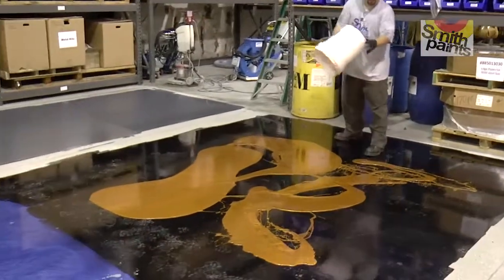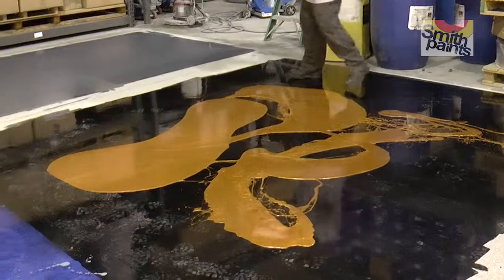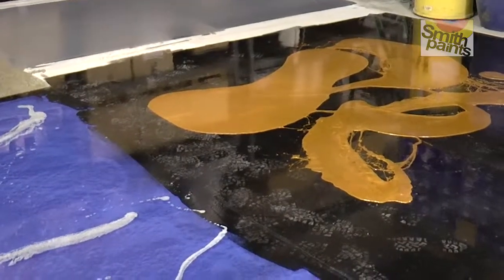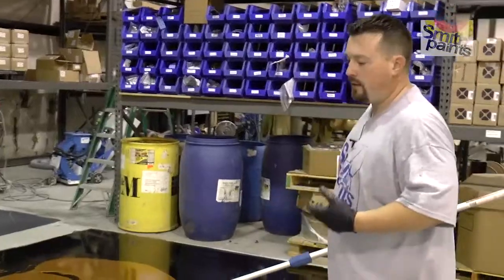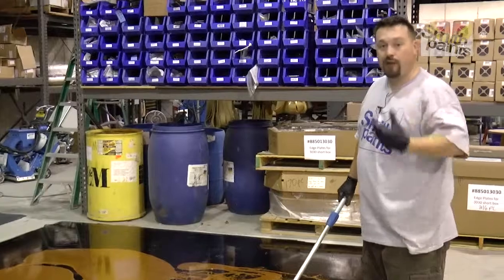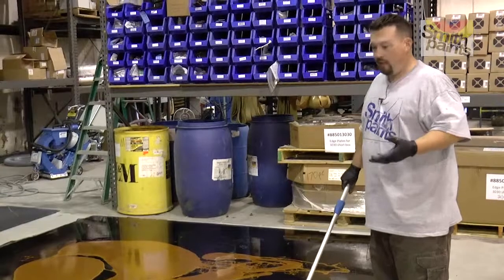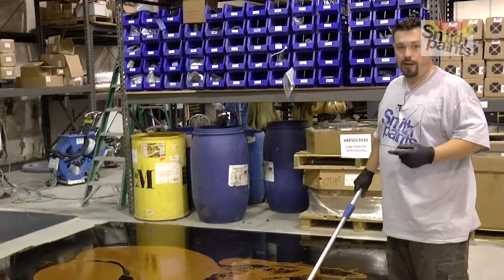This is an epoxy with our Sunrise Metallic and Lustre pigment. We're going to highlight this with graphite and some silver. The advantage of the epoxy is that you can go thicker so it's going to hide more. They model differently than a polyaspartic, so it is a slightly different product. The difference between a polyaspartic and an epoxy is the epoxy allows you depth — so if you're trying to fix a floor that has a lot of imperfections, you can build that up and smooth it out. Epoxies are harder than a polyaspartic.